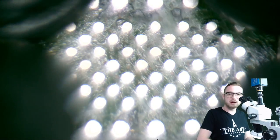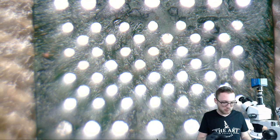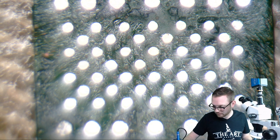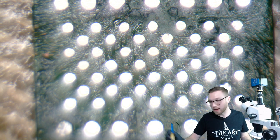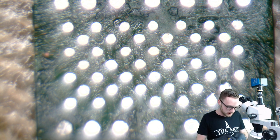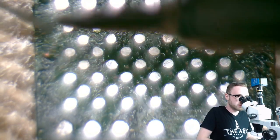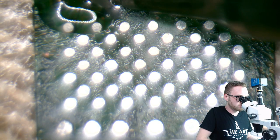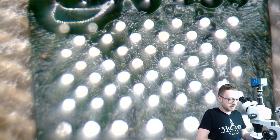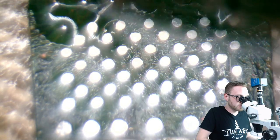Right, so let's get our chip under here, and all we're really going to do right now is add some solder to the pads themselves. I always do it in order so that whenever I'm doing it, I'm not running back across another one and taking solder off another pad. But like always, you do you, whatever makes you happy. So let's grab some solder, get some flux going, and get these pads full of solder. I don't even think I really need the microscope for this, but whatever. Bloop, bloop, bloop. If you pull away a little quicker, it's going to be easier to get more solder on it. You don't need the world here, but a good amount's definitely going to help this process, and you'll see why here momentarily.